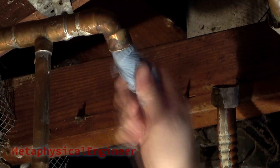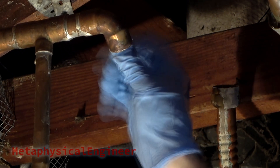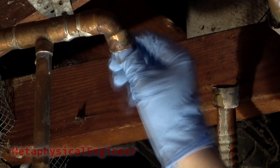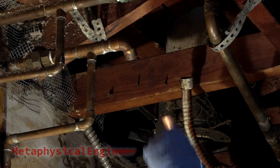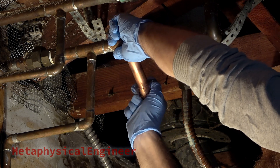I can see a matching erosion track from the original failed joint inside the elbow, along with leftover solder. Cleaning this area is extra important. I sanded the track mark area down to the copper and smoothed any roughness in the rest of the socket. Got flux in there as well so that side flows correctly, and made sure to fully seat the pipe. The strength of the joint comes from the filling of the overlapped area with solder.